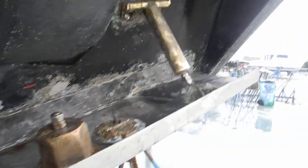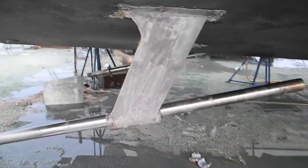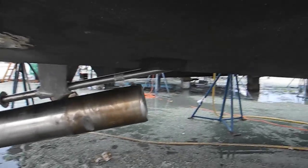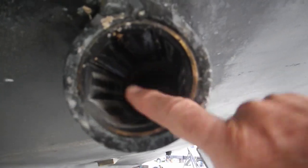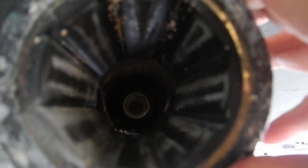Trim-tab actuators, or ram rods if you want to use that word. I'm glad I'm not carrying anything electrical because I'm walking around in the water. You can see the V-strut — V like Victor — you can see how big it is; it's got a vertical and a diagonal. Watch this shaft: you can see the end of the shaft where the key goes — see that square hole? That's the key, and that slides up inside of this cutlass bearing. You can see the grooves in the cutlass bearing, and that goes all the way up inside the boat and connects to the rear of the transmission.